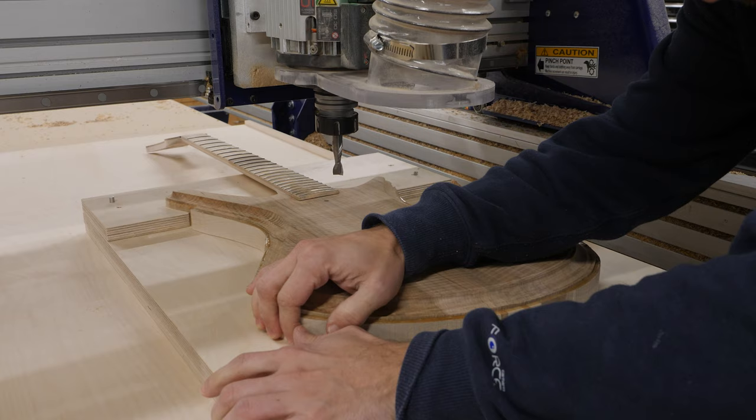The first time the cutter went over the fretboard I held my breath — please work, please work. I was a little nervous it might just decide to take out the bottom of the fretboard. After the outside is cleaned up, I have the machine doing a roughing pass to clear out the majority of the material inside the pickup cavities, and then it comes back with a smaller cutter and takes off just a light pass to clean things up.